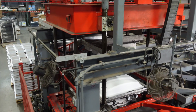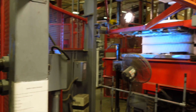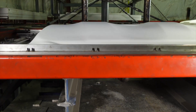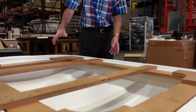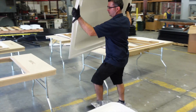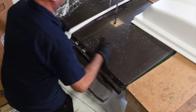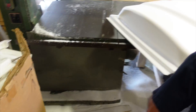Here's an example of a four-station rotary machine. Directly opposite is a preheat oven, then the second station is the full oven, here's where the part is molded, and as the carousel comes around, this is where we load and unload the material. A lot of olefin parts want to shrink — this is a cooling fixture made to keep the product from shrinking too much so it fits on the golf cart properly. He's trimming the selvedge off this part, and all of this scrap will go back to be recycled and made into sheets.